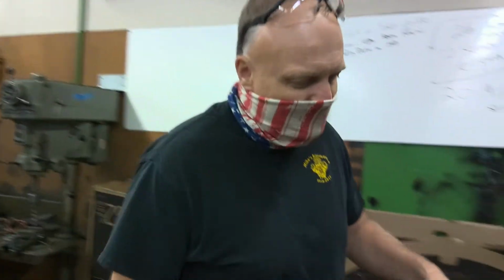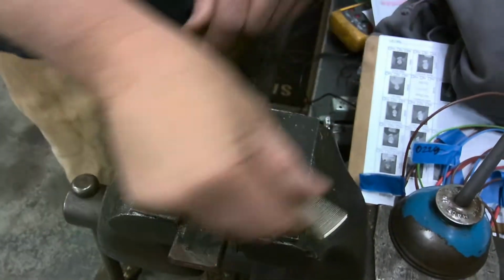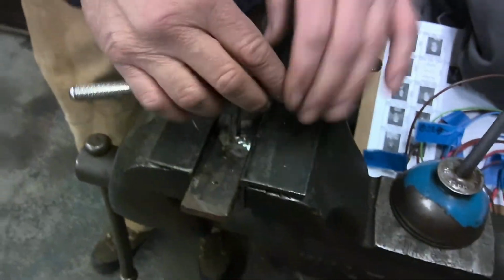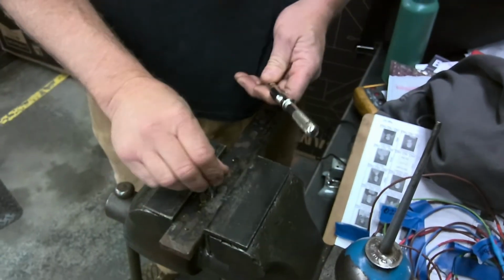Nice. So we screw back out like this. Now, at this point, you're like, I'm going to go super fast. Don't do that. Go slow because I don't want it to fly across the room. I don't want you to drop it. Remember, the taps are somewhat brittle. They're not eggshell brittle, for heaven's sakes, but they're not soft. They're not hard either. They'll take some abuse.